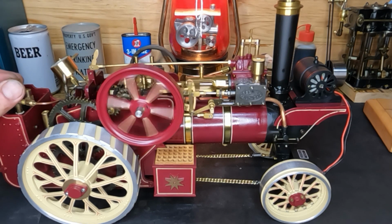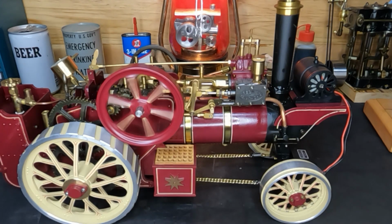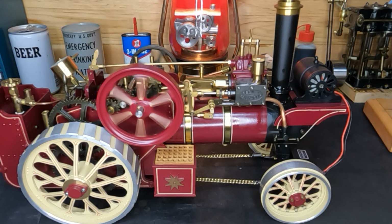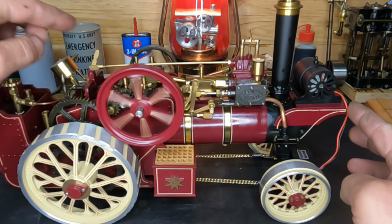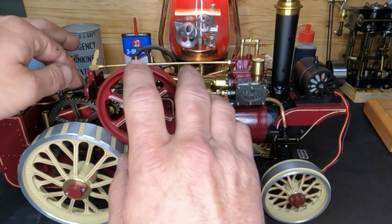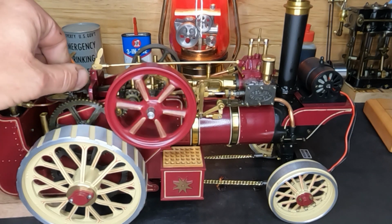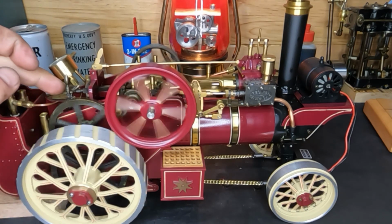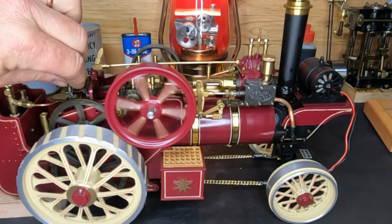Look at that, guys. This is something I've wanted for a long time. And it looks like just by heating this steam chest up, our leak's going away. Not saying it's fixed. We're still going to get after that. We'll open it up and make sure everything's tight. But, alright, I guess with that said, our steam valve is closed. Take it, put it in gear. We'll put our block back underneath. How cool is that? Let's see if we can get reverse.